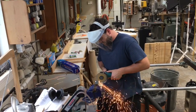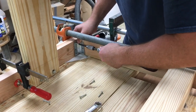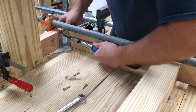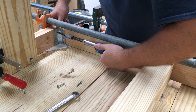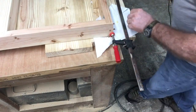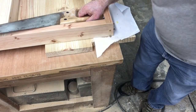To add some extra strength to the corners we wanted to use metal brackets. There were none available that were the three inches we needed, so we just took what was available and cut them down to size, then screwed them into position in each of the corners. This very old Yankee screwdriver has seen a lot of use in the past few weeks — I still think it worked better than the drill. Once the glue is dry and the clamps are removed, it's time to cut the ends off of the dowel rods and get those flush with the side of the wood. Any little bit left over will just get sanded off — I just have an old hand saw, and that works just as well as those new fancy ones.